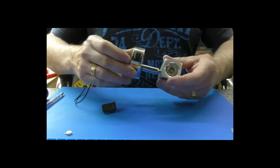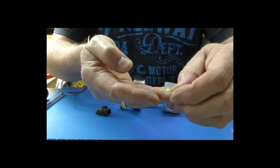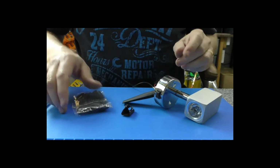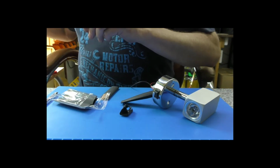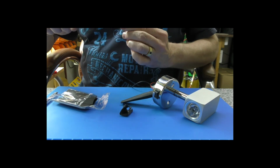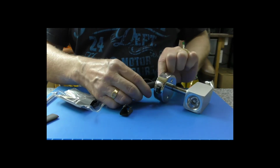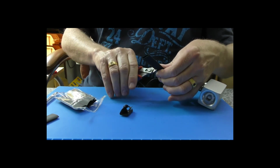So we've got 2 spares now for the other 4 at the lounge end of the Caravan, and as I say, these are just 50p from eBay, so well worth repairing and quite straightforward. If you ever do have to repair the circuit board, then this heat shrink tubing of this size it is. Let's have a look. Well, folded in half, you're talking 20 mil, so yeah, flat measurement 20 mil, that is a perfect size for this. So I am just going to poke that in there, and we'll just trim that off, and then we'll get some heat onto there and get that sealed up.